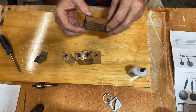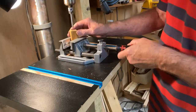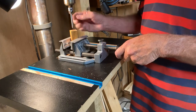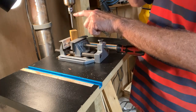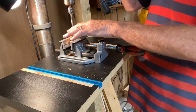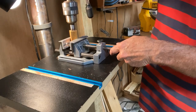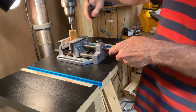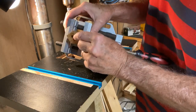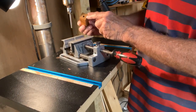Twist the barrel into the hole of the blank — it dries in just a few seconds. You'll also need a seven millimeter barrel trimmer, the same trimmer used for making pens. It trims your blank so it's even and square with your barrel. Turn it until you can see the brass at the same level as your blank — that way you know it's square. Do the same thing to the other end too.